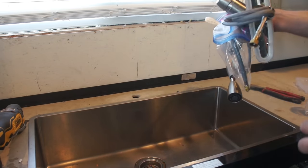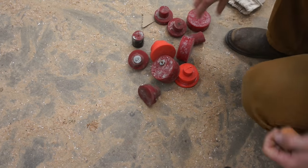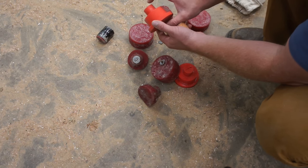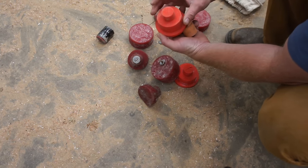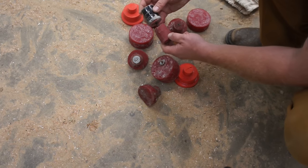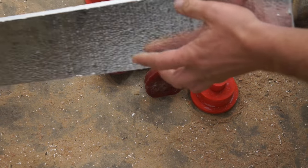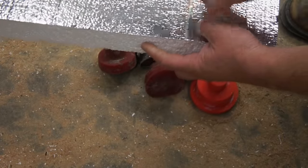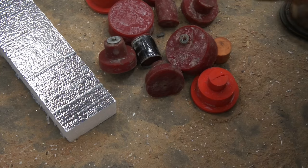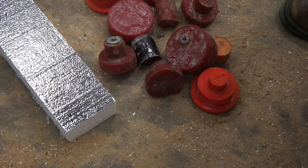When choosing a knockout for your faucet to go through your substrate, you're going to want to determine whether or not your faucet stem has enough thread to go through a two-inch countertop — and it appears that this one will, no problem. Otherwise, you have to use a knockout with a bigger base on it. I keep a whole big bag of different styles of knockouts. There are a lot of different ones for different things — this is for a drain in the bottom of a sink, and this one is for a faucet that might not have a long enough stem on the bottom to go through a full-thickness countertop, where you need a bigger knockout for the washer to go. Not all knockouts need to be purchased — you can improvise with foam. You can easily take a hole saw and cut out a knockout out of foam and tape it. You can also use PVC pipe. Perhaps the best piece of advice I could give you as far as knockouts is try to stay away from wood, as wood will absorb the water and swell and cause problems.